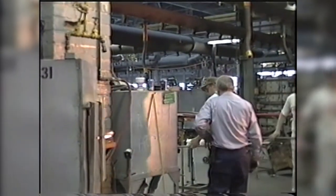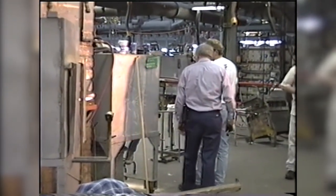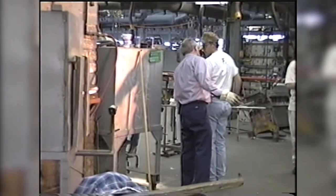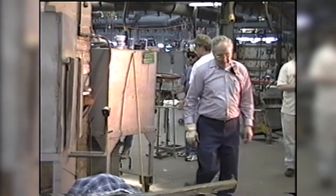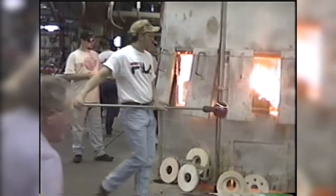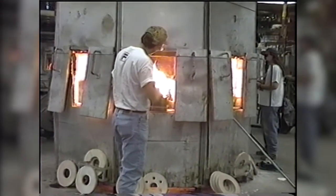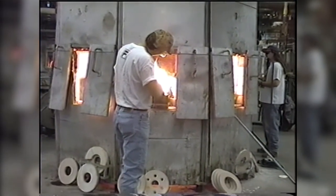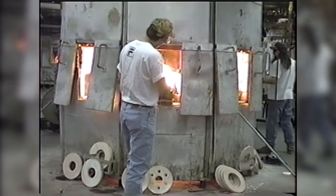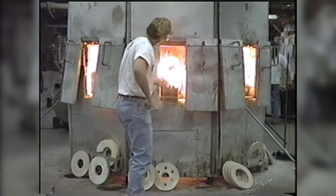Again, they're bringing over and spraying it, and that chills the piece as well. So you've got to get it re-hot, or hot again, and keeping the handle hot so that the heat in the handle is balanced with the heat in the bowl is one of the problems you have from an annealing standpoint, because you'll notice that handle, once it's in that snap, never gets heated again. In hindsight, they should have probably put it on a burner or a glazer and reheated the handle before they annealed them. They probably would have had a lot more survive if they'd done that.